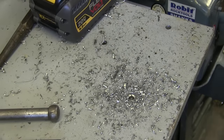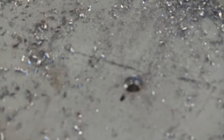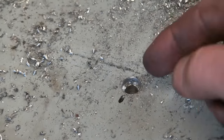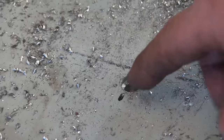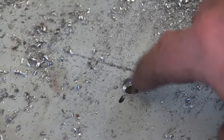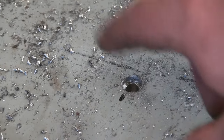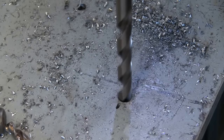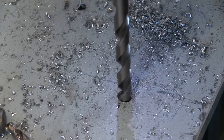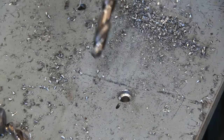Okay, here's an interesting problem. Right in there is a chip that hasn't been evacuated — it's still part of the parent metal. It's a barb. And what's happening is the drill bit wants to feed itself in there. This is what breaks your flutes. This is what breaks your cutting edge. So you need to be very careful when you have a flute like that — it gets caught up. You want to break that edge. The way to do that is carefully run the drill in reverse, and flop that thing over, and then hit it again in forward. Okay, there we go — we took off that little dangly bit, and we didn't ruin our drill bit.